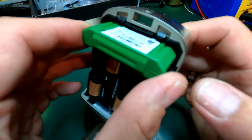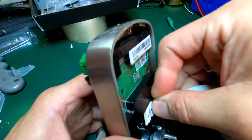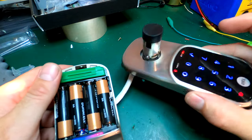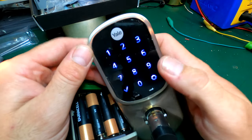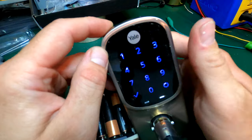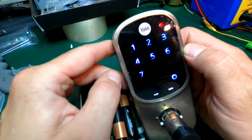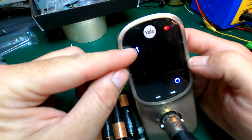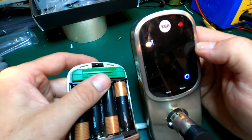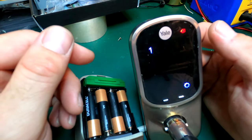I wanted to switch the Z-Wave module to the new lock, so I had to power it on and go into activate mode. On this lock specifically, the Z-Wave join and leave mode is accessed via your password or code and then the gear icon. If you see a seven, that means the wireless module is installed — select wireless module setting mode, then join the wireless network. Once your app is in Z-Wave add mode, hit this and it will transmit and be picked up. Same thing if you want to leave the network — there's a two or three option to leave — you have to activate the signal to remove it.